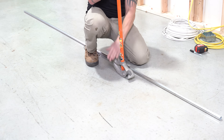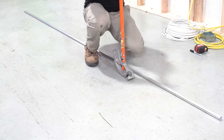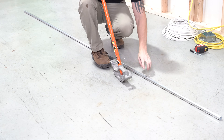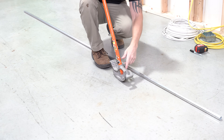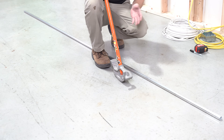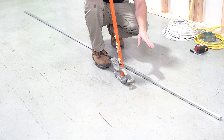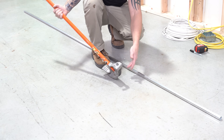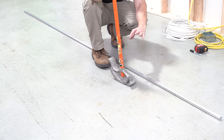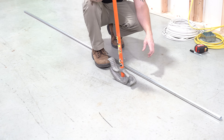One really important thing when you're bending conduit is you don't just pull like this. You actually need to step downward and push while you're pulling. That's going to keep the actual conduit tight inside of the shoe. A lot of times when people bend, it actually lifts the conduit up and kind of bends the whole pipe, and you don't want that. You want to make sure you're just applying it to the shape of the shoe. I'm using aluminum conduit, so you're going to notice this is super easy to bend compared to steel.